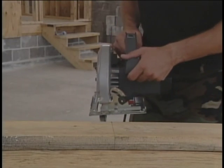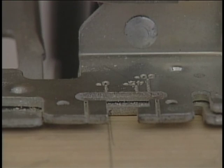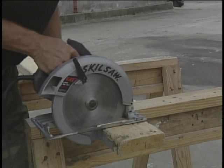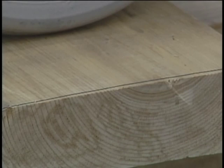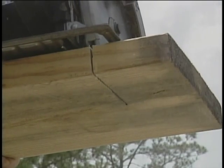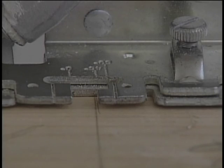A line guide is also located at the front of the saw to help you follow the line of cut. Because of the various blade thicknesses, make a sample cut in scrap lumber to verify the actual line of cut. The guide's approximate line of cut may be off just a little. Also note that one side of the line guide is for the vertical cut and the other side is for the bevel cuts. The guide is marked accordingly.